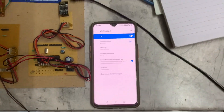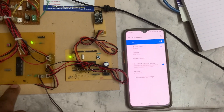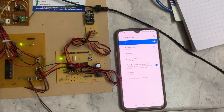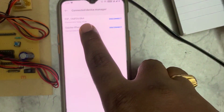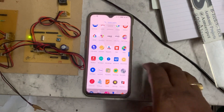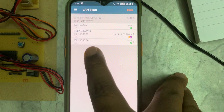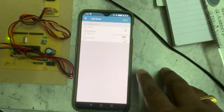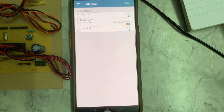After switching on the kit, you will see the ESP8266 in the connected devices list. The Wi-Fi indicator light will blink indicating Wi-Fi is initialized. Check your phone — you can see the ESP8266. Open the Network Analyzer app, do a LAN scan, and find the IP address. For example, 192.168.43.90 is the IP address — note it down, as it may be different on your phone.